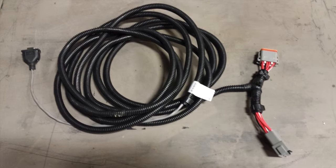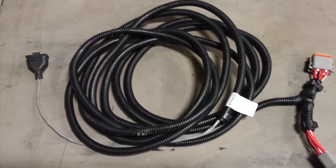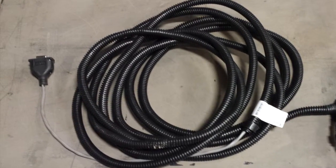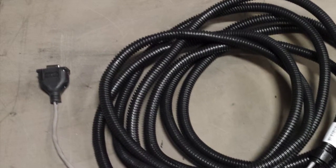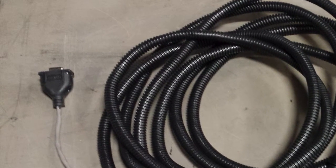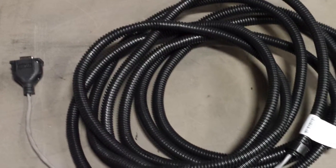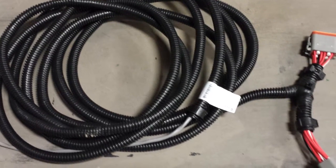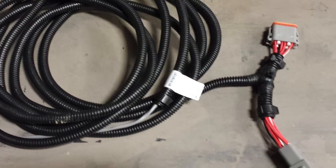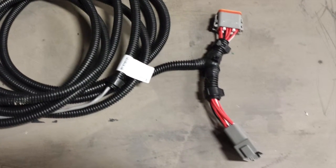There are three total connections. You have your nine pin serial connection which plugs into your Viper 4 — it's a small black style connection that looks like it plugs into the back of your computer. The other side is a tee fitting which has two Deutsch ends on it, a male and female side, and that is going to plug into our factory location of our Starfire receiver on your customer's John Deere tractor.